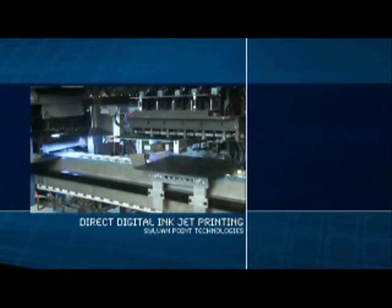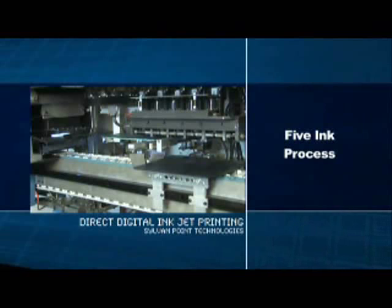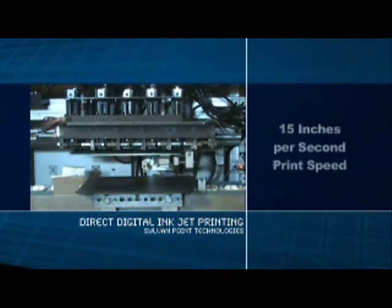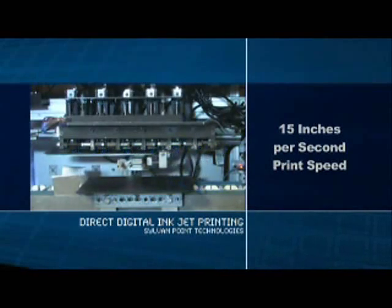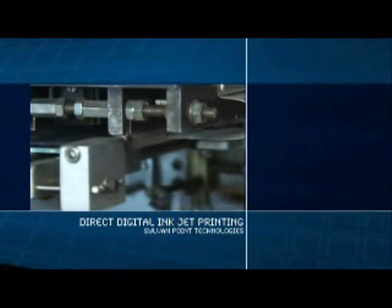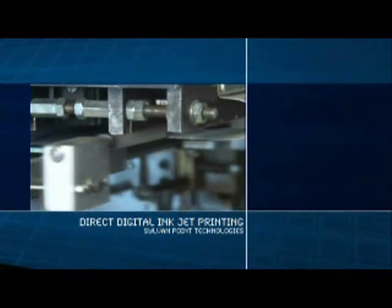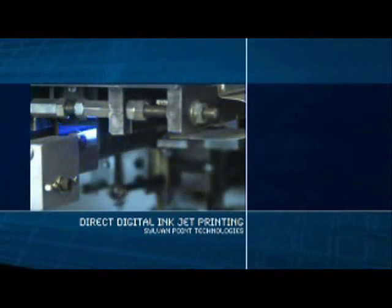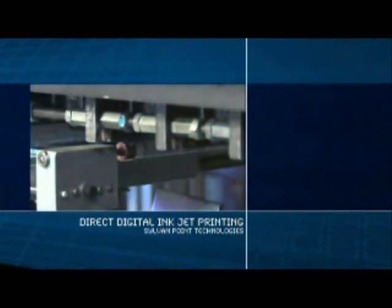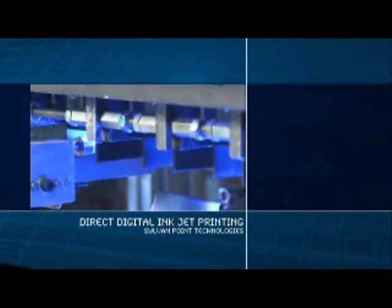The Sylvan printer applies five ink colors in sequence: white, cyan, magenta, yellow, and black. Our printer features highly specialized print heads capable of print speeds of 15 inches a second. As the mandrel carries the pen under the first station — the white print head — it comes to a stop. Then it's rotated by a stepper motor while ink is deposited, and rotates once again to deposit more ink. The stop, rotate, and print is repeated for each color as the pen is transferred under the stationary print heads.